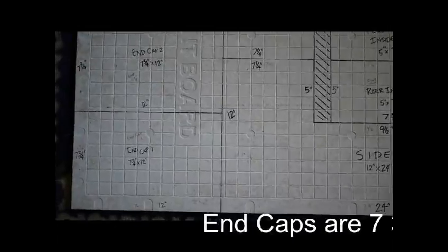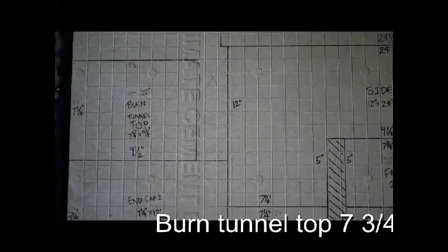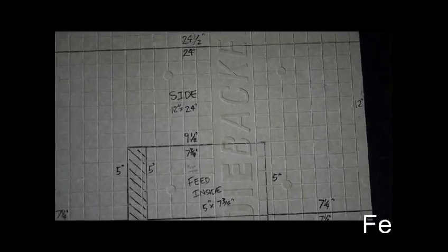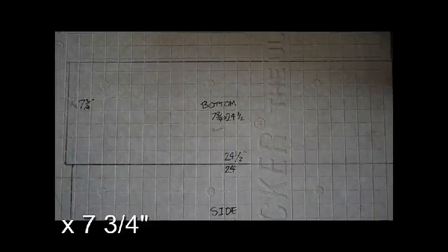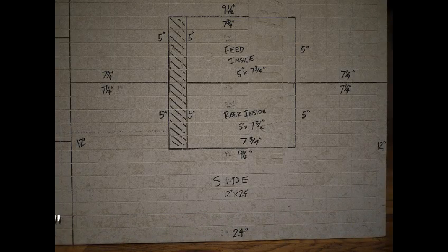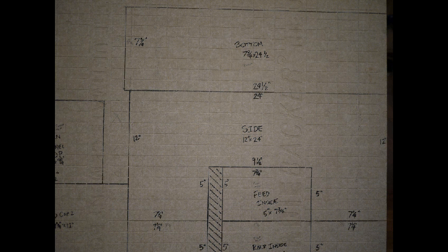We're going to do the same as I've done before — run some pictures through. Here we are starting with some measurements. In this one I'm laying it out on hardy backer. The measurements here I did on purpose to show you the finished inside dimensions. If you're using wood, which you can do to make this core, you just want to size the measurements such that when the wood burns out, these measurements are what you're left with inside. I expect this hardy board to break out eventually, but I did want to build it with the dimensions of the finished inside so you could see what that would be. So if you were using half inch wood, you would subtract an inch all the way around from these measurements, so that when the wood burned away, the clay was left at these measurements.